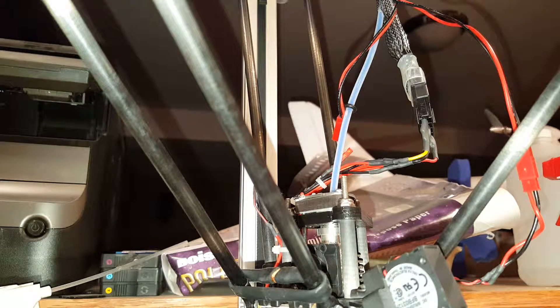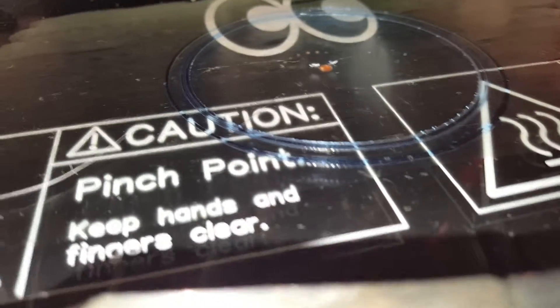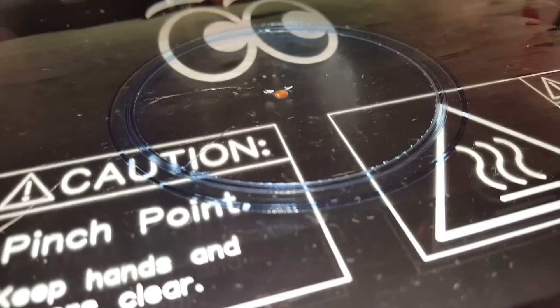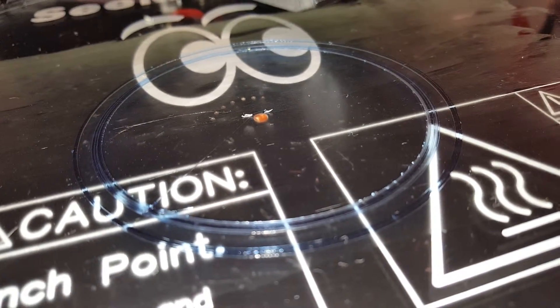This video is to show the Prometheus hotend and the Bowden tube and the troubles I've been having. During my prints, I can't get a first layer to print at all. Here's a small example if you can see on the table — that's as far as it will go before it tries a transition or a retraction. And when it tries to do a fill or move to a different spot, that's when the Bowden tube pops out.